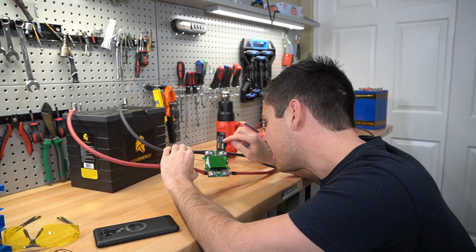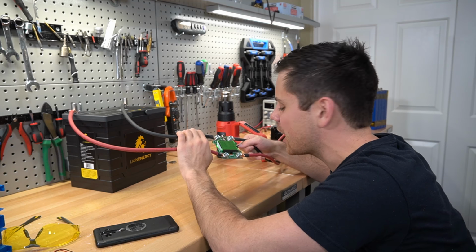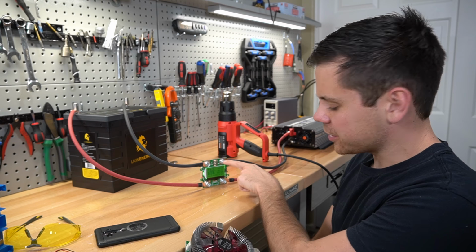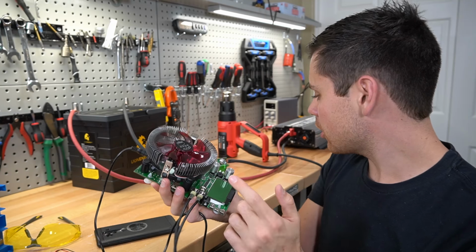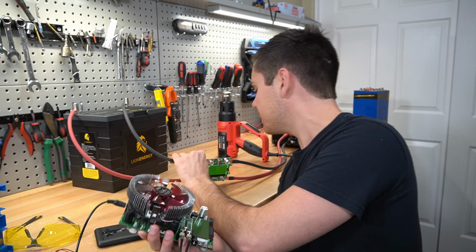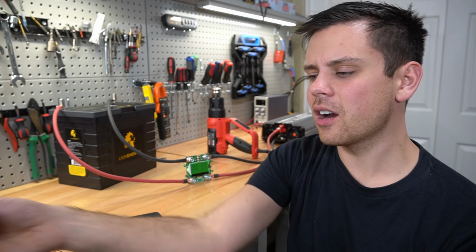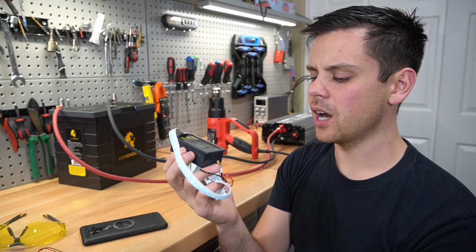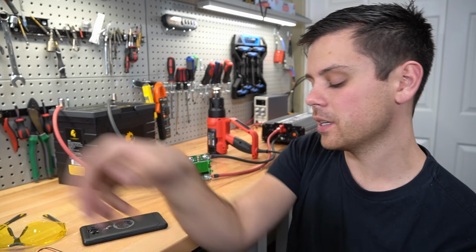And if you think about it, look at how small this shunt is and it's expected to pull 100 amps. If you look at our other cheap ones, so this one has 4, but this one can only handle 20 amps and only has 2. So just based off of common sense, I would imagine this shunt would be bigger. This is actually not that uncommon. This Hall effect sensor had the same issue. I think it was rated for like 150 amps, but could only do 100 amps. So this is very common, unfortunately.